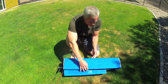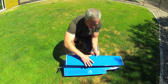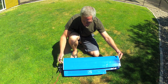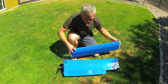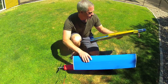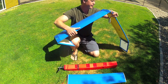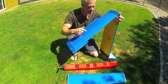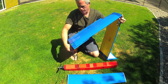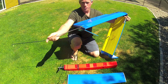Here's the larger cord version with a 7-inch canard and a 7-inch main wing with a 1.5-inch control surface. It's also 32 inches in length, governed by the fuselage. The canard itself is actually 30 inches in length, and the main wing is also 30 inches in its folded position. This one uses a slightly different assembly mechanism where each wing is equipped with a carbon arrow shaft channel inside for additional rigidity and improved strength.